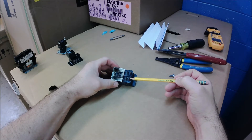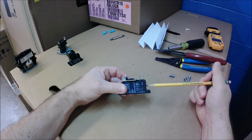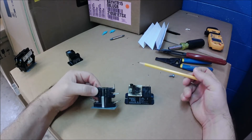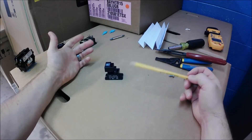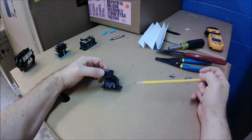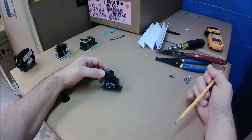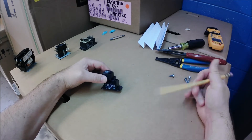I've had people replace these DC relays with a 24-volt AC heat sequencer, and I think that's a very common practice in the field. I'm not going to knock it. Maybe we do lose some efficiency when we get rid of a DC relay, but realistically in the field — I've already got a 24-volt system, so I'm pretty sure if I put a 24-volt contactor or a 24-volt heat sequencer in there, it's going to work just fine.